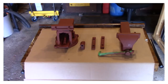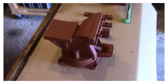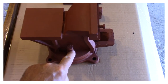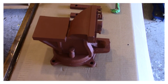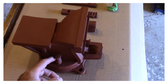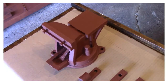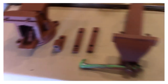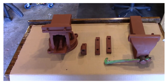Krylon does a fantastic job — I only waited about 20 minutes. Now take a look right here: that used to be just a couple of pins that went through there and you tighten it down because that's a swivel vise. I had more problems with that because it would just move around on you all the time, you can never get them tightened enough. So I took the pins out and welded a nut on the top. It's very rare that I have to swivel that vise, but if I do I just get my ratchet out and loosen it off. Let's get the orange paint on.